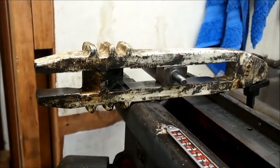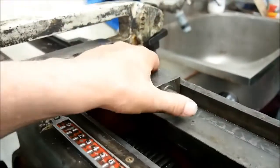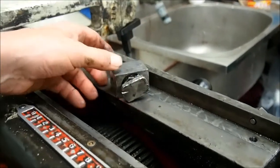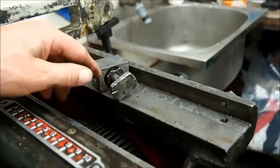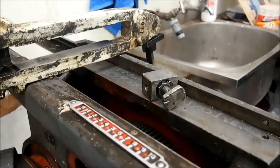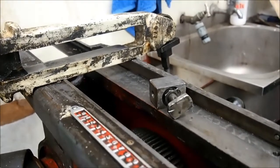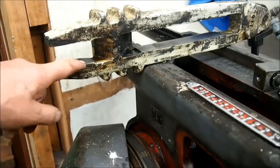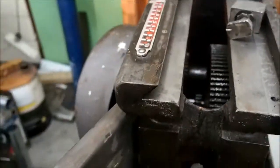I've done a quick measurement of that slot and it's not quite even, so I'm not quite sure what to do about that — whether I'll machine it parallel. I'll certainly make up a new block; that's not at all difficult, it's steel, not cast. There is a cast inner which has come to grief at some stage in its life, but that's not an issue.